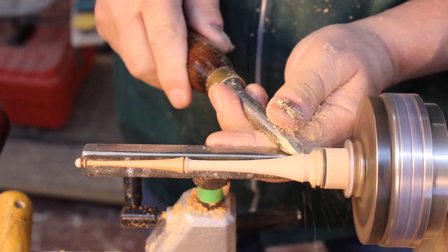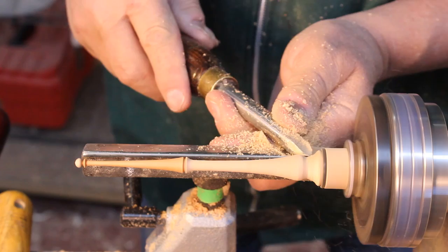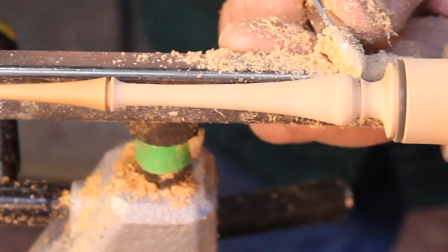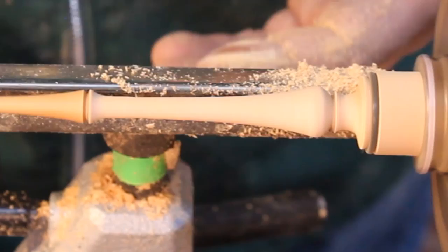The tool I'm using right now is a spindle gouge, probably a three-eighths inch gouge, and I repurposed it. There's not a lot of flute left on it — maybe an inch and a half or so — and I've got a very sharp angle ground on this to make a detail gouge. Now I've gone to an even smaller detail gouge to complete my finial, working right up to that o-ring area and doing some final shaping. It's really more of a cut than a scrape, and that allows me to do a little bit of fine tuning on the spindle and get rid of some of those grooves I've created with the tool.